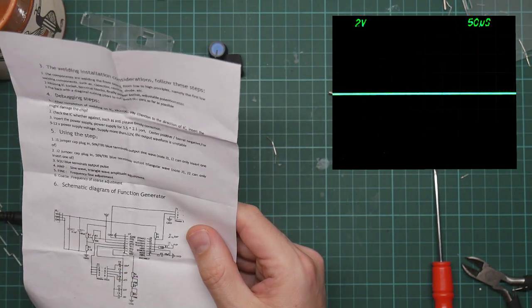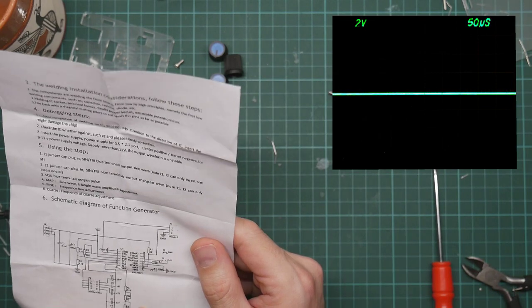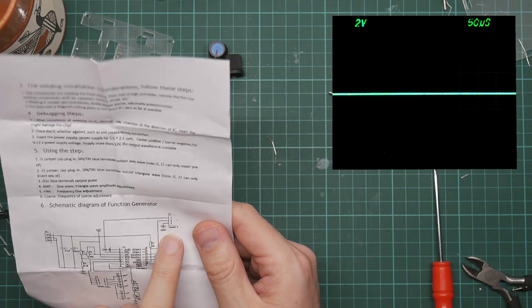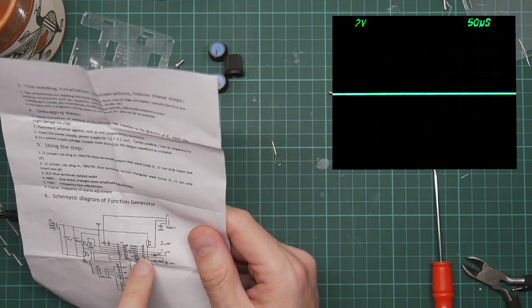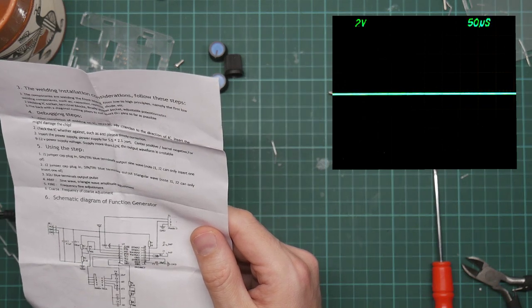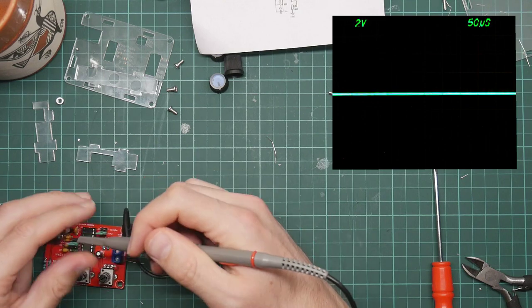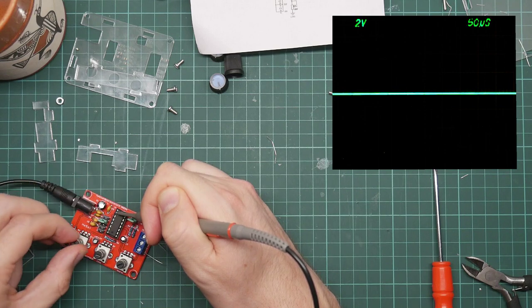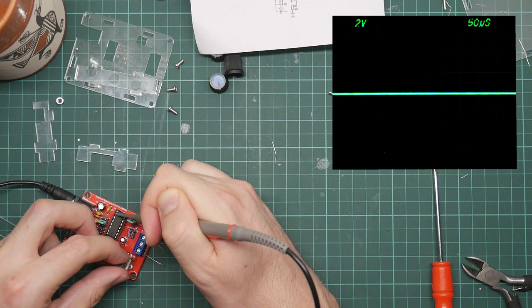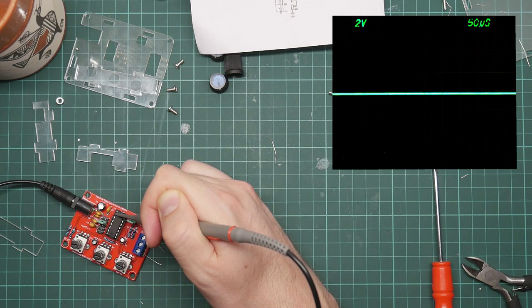And here's the pinout of the chip. So we've got, here is the output, and so pins 11 and 2 should contain the waveform. All right. Well, pin 2 is this one. There's nothing there. Just checking the... Okay, that's a zero.